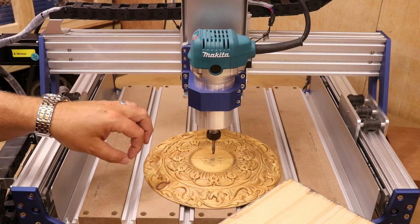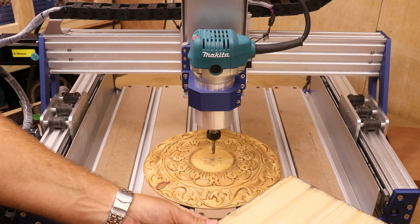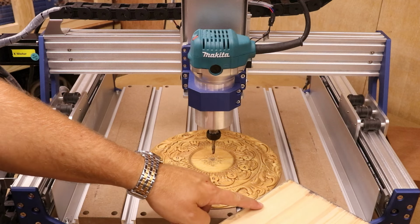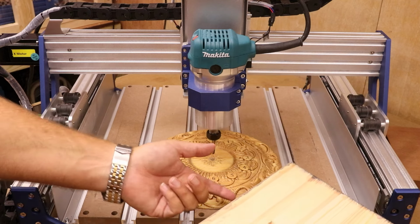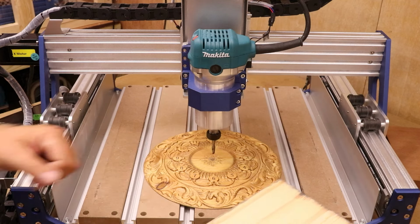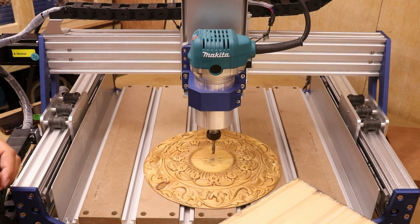Now one small thing to factor in, if you are using clamps or something, this can be okay. If you are using something like blue tape and CA glue, the blue tape and CA glue may lift your material up slightly, so you may have a fraction of a difference between this material and that material. Obviously the easiest way around it is to stick some blue tape onto this just to mirror the thickness of that between the two pieces, but ultimately it's going to get you pretty close if not perfect.